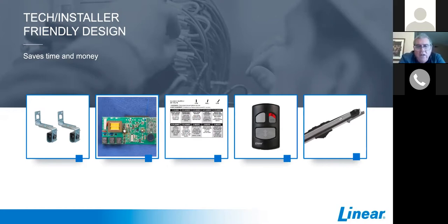The photo eyes are interchangeable across the platform. The board there that's lit up is our AE, that's our 40 board, designed for all AC openers. On the back of the machine, we have indication of up to 7 flashes, depending on which opener it is. So if somebody's troubleshooting a residential operator, the flashes are right on the back. For example, 1 flash is the transmitter has not been taught in. 3 flashes is the photo eyes aren't working correctly. 4 flashes is door pressure, and so on.